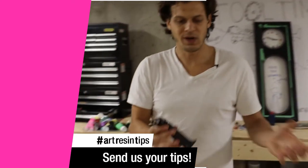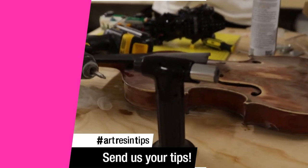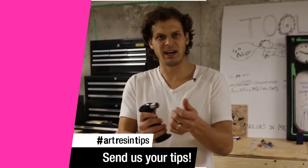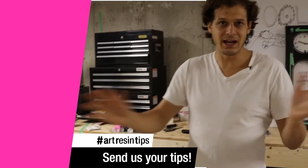And number two, when you fill this full of butane the gas is going really crazy. If you let it sit for 10 to 15 minutes, that's when you'll have the best flame. Sometimes you fill it with butane then you light it and it just isn't as big. You've got to let it sit, and that's with any type of butane torch.